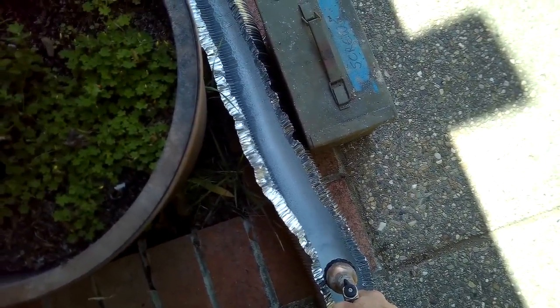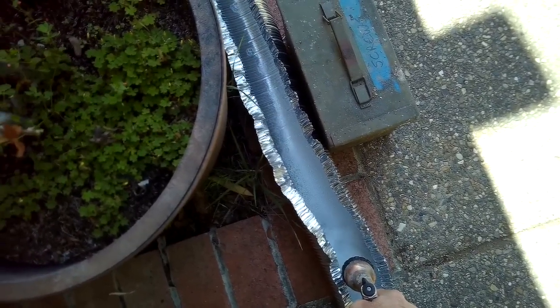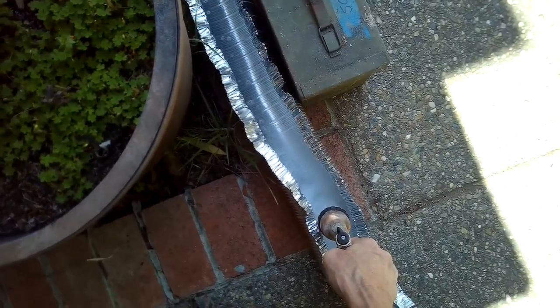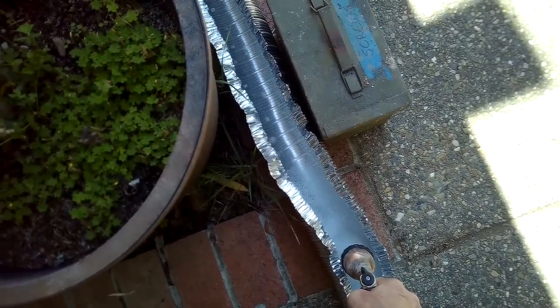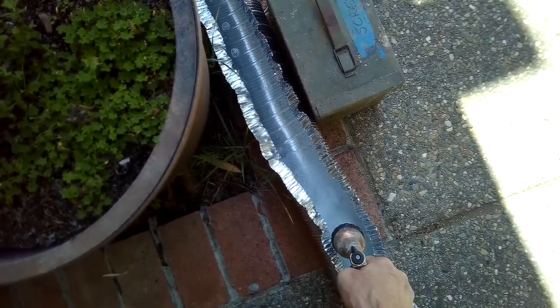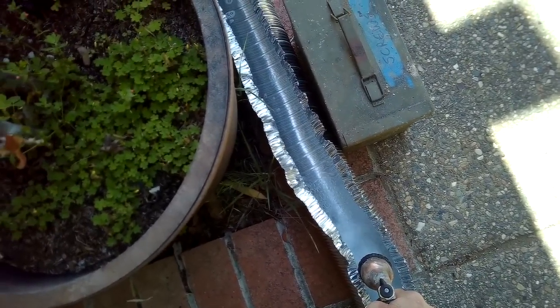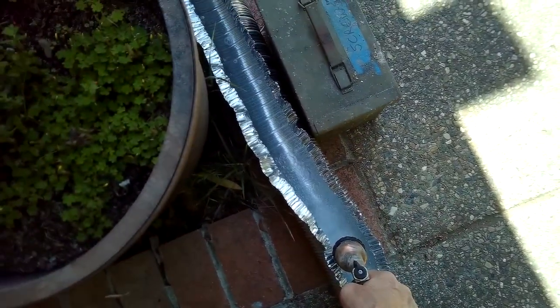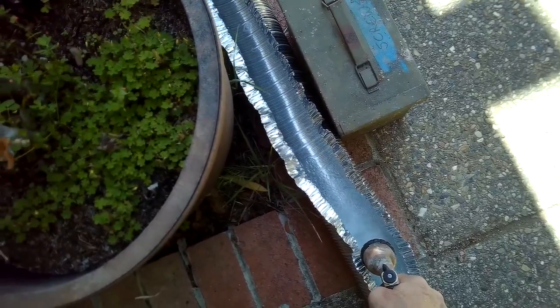I'm going to put the blade in, mainly trying to heat treat the ha — maybe an inch up on the sharp where I'm going to be sharpening and hardening it. I don't need to fill this all the way with oil because I want to keep the spine and the tang a little bit softer so they're not brittle, but I need to have the ha hardened so I can sharpen it. Got a little leak right here — check that out. The other side is pretty good.